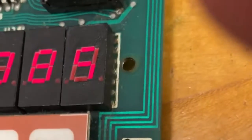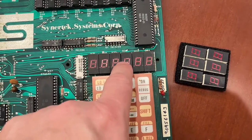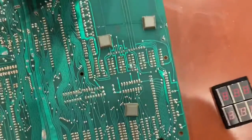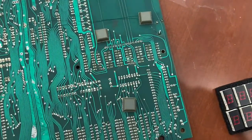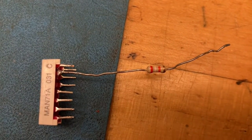These are not socketed, so I'm going to have to replace these. I need to replace these dodgy displays, where some of the little LEDs aren't working, with these displays that I got off eBay. I first need to desolder these. Dang it — I snapped off one of these legs while trying to get it in, so I'm rigging this up here.